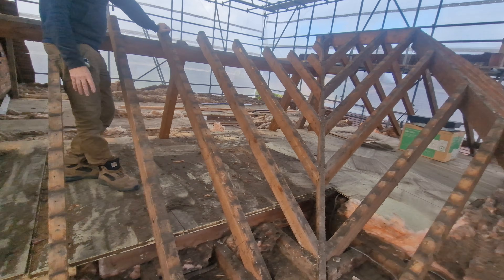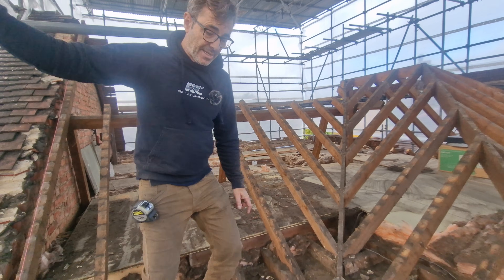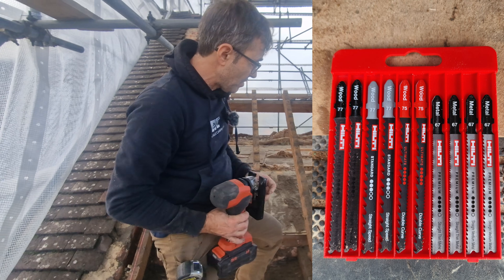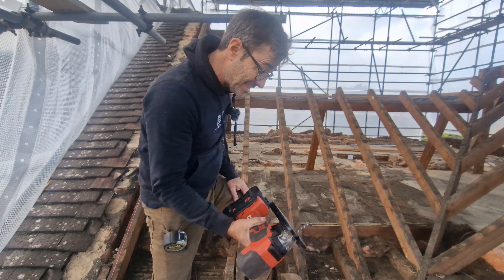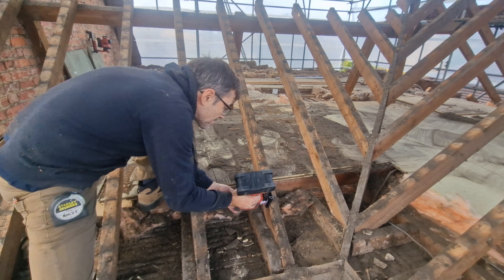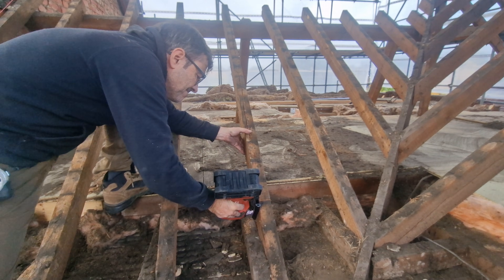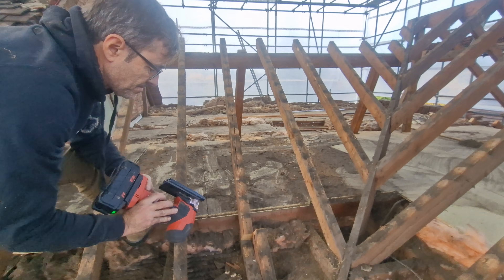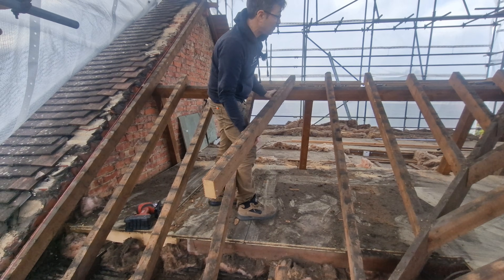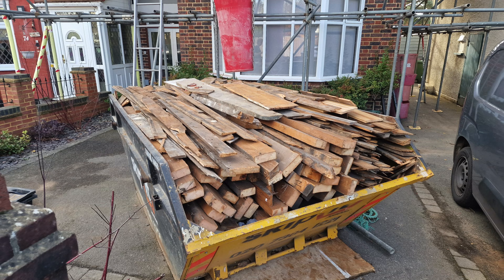You can see how much mess falls through a roof like this, especially when there's no underslate felt — which there wouldn't have been back in the day. I'm going to cut one of these to show you close up what it's all about. This blade is a bit dull but it's done the whole job — the very first one I cut took the edge off a bit but it still lasted the whole job. The beauty of it is using the leverage to pull the nail out. So we're just going to pull these out and get it all skipped.